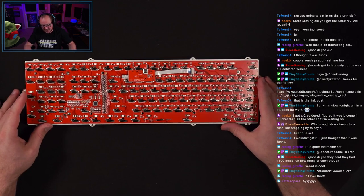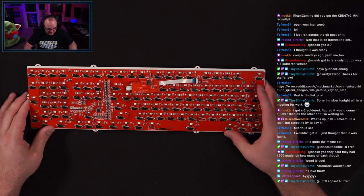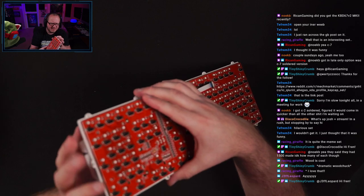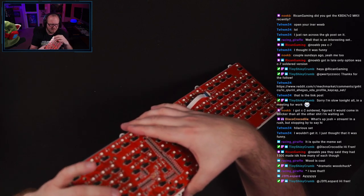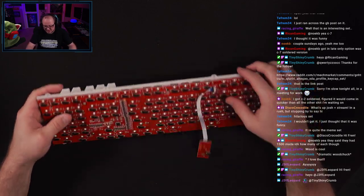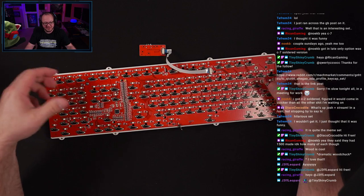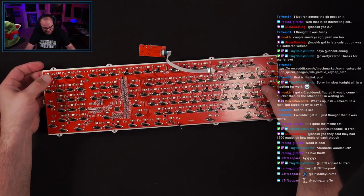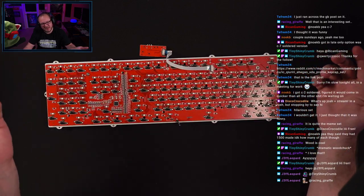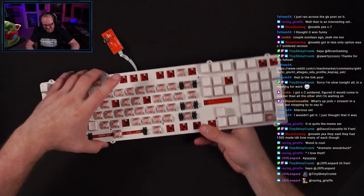How you doing, man? Yeah, so we're playing with this wood drop board and it's kind of a sad story. The PCB and plate are fairly separated. Something that I like to do to ensure everything works is start putting the PCB together with the end plate and pushing each individual switch in while holding the Kailh socket so that it doesn't pop off like this one and this one did. That looks like pretty much a necessity for this board.